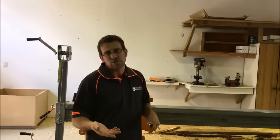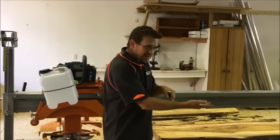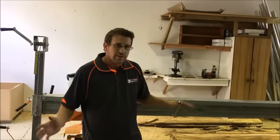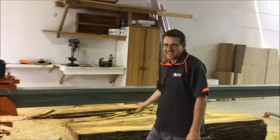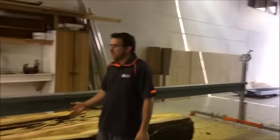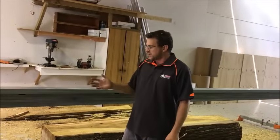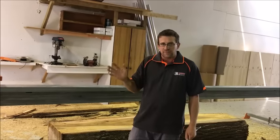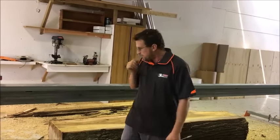And the same applies to horizontal. The horizontal full depth cut should go straight through, exit clean. You should be able to come straight back into the cut without spraying sawdust everywhere. That's when you know you've got your adjustment right. With crisscross, it can be irregular, so don't rely on crisscross. The real scenario is if that blade can cleanly cut a deep vertical cut or a horizontal cut and enter back through it without spraying.